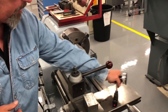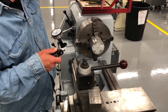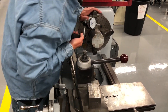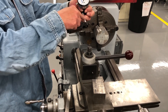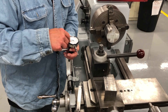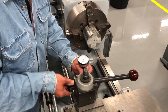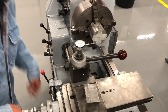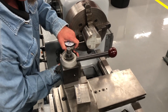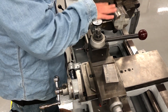The old boys at Murray showed me this nice little trick so you don't have to stick an indicator up here and always have to turn around and look at it. Basically, you take a little piece of three-eighths, turn it down until it fits your one-inch dial indicator. Each division is one-thousandth per revolution; one full revolution is a hundred thousandths, and it travels up to one inch. We can stick this right on our lathe and come right over here — now I can look straight down at my indicator. You want to put a load on this indicator.